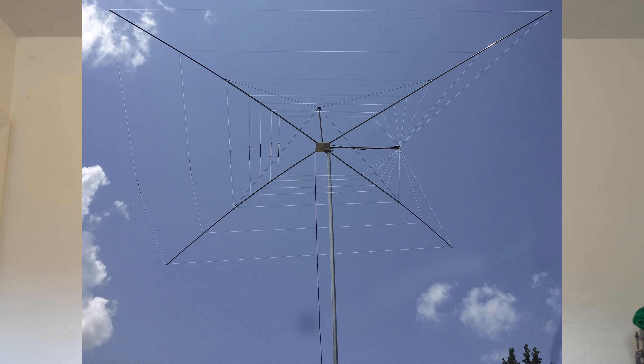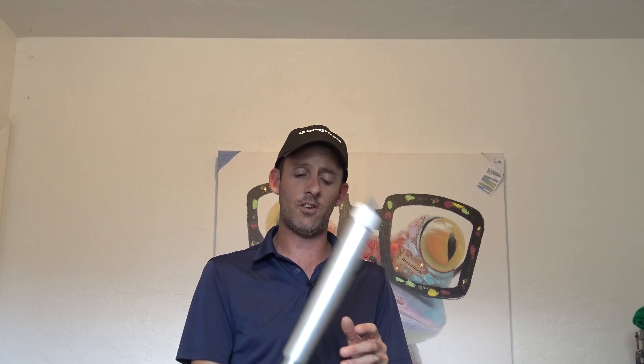Same thing with the cobweb — the eight-band cobweb and the five-band. Those are individual bands that are tuned and resonant on that antenna. If you've got a cobweb with 80, 40, 20, and 10-meter hamsticks, you could tune it for 15, but it's not going to be as effective as having a set of 15-meter hamsticks on there. Those are also compromised because they're shortened with windings of wire, giving you the electrical length of the band you want without the full physical length.